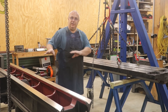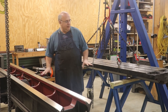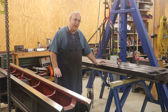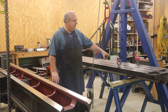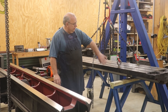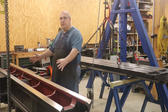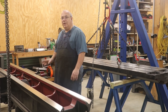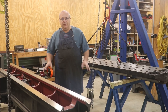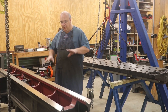We've got our table here, also been ground to match. We're going to start scraping in the base, and I've got oil grooves cut in. The game plan is to use the ground surfaces on the top as our master — basically our straight edge that we're bluing up. We'll put blue or black dye on the table, put some contrast on the base, print it, find our high spots, and start scraping. First though, I'm going to put a crosshatch scrape pattern on here blindly across the whole deal, giving me a pattern to start working off of.